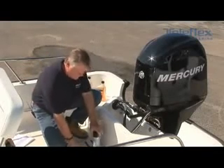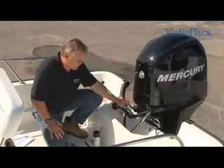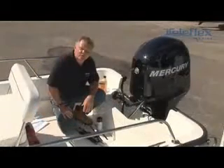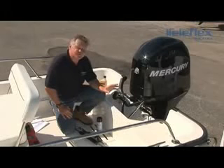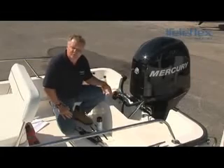There are three points of attachment for the steering cylinder: the support rods going into the tilt tube on each side, and the tiller arm. One last thing regarding the tubing — make sure you give yourself enough tubing to allow for the cylinder travel back and forth inside of the splash well.